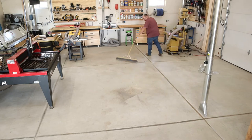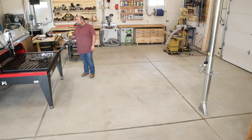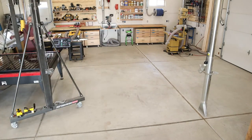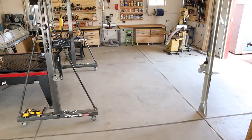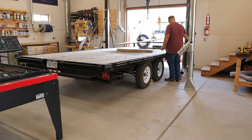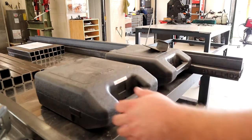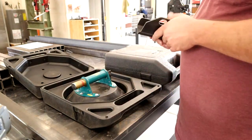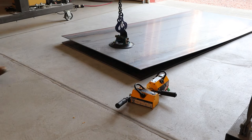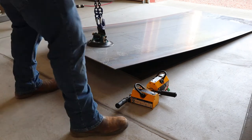I'm about ready to use a big rolling gantry — it's a Harbor Freight purchase — and it really makes it difficult to move if there are any small rocks or things on the floor that might get under the wheels, so I always clean up really well before I use it. They're also not fun to use by yourself — it just requires a lot of shuffling around. Here's another problem when you're working by yourself: I use magnets to lift the sheets. That's quarter-inch plate and there's three of them stacked there, and the magnets were strong enough to lift all three at once. So I had to get them separated — I use these suction cups all the time to separate sheets of steel out to individuals so I could pick them up again with the magnets just to get them on the plasma table.